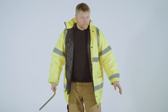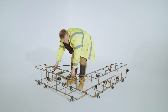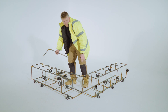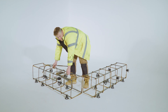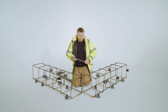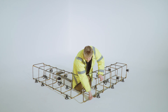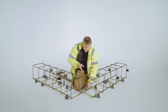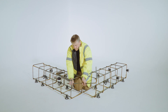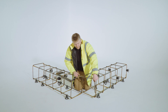So here we have a corner section. You'll see that we haven't pushed this right into the corner. The way we're going to do this is to have the corner like that, and we're going to create this corner of reinforcement with eight L bars. We're going to use an L bar here, here, here, here, and exactly the same here and here — that'll be your eight bars.